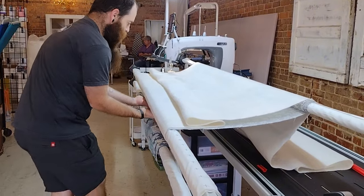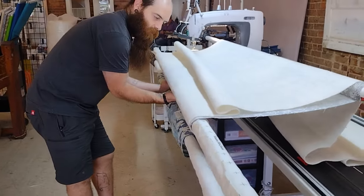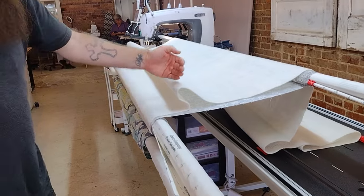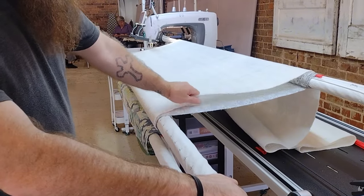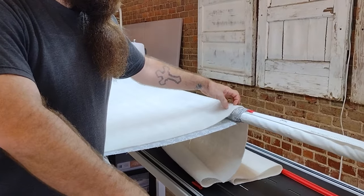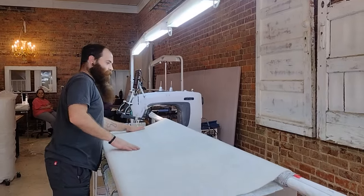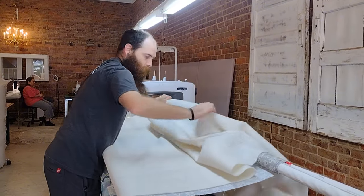Make sure — be careful, there are needles sticking out. You want to make sure the pins are sticking and that it all rolls up together as one. Keep going. All that slack has worked its way down to nothing, so when you get to where it's flat again, go back and pull more slack. If you don't, the tension of this bar turning will over-tighten and stretch it. The scrim sticks to the backing really well, so grab it and pull up a couple folds.